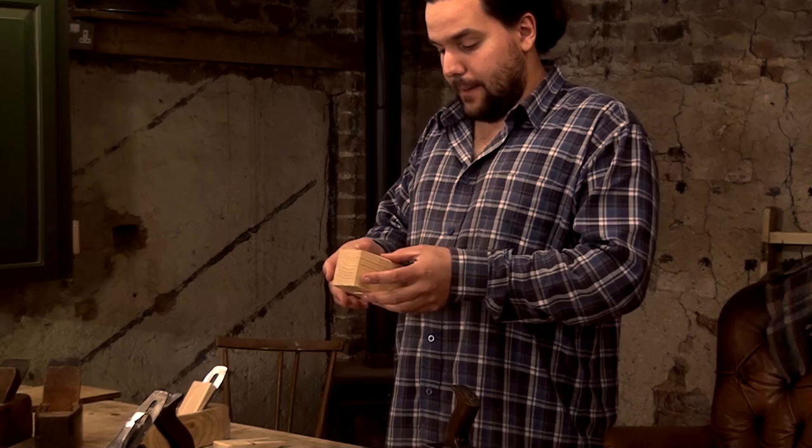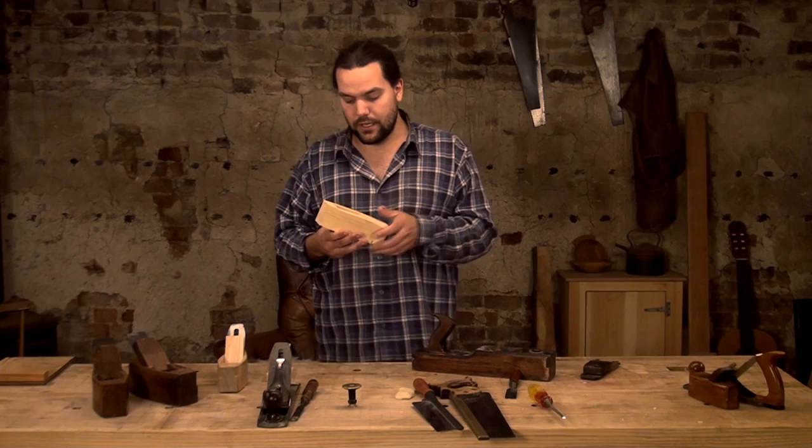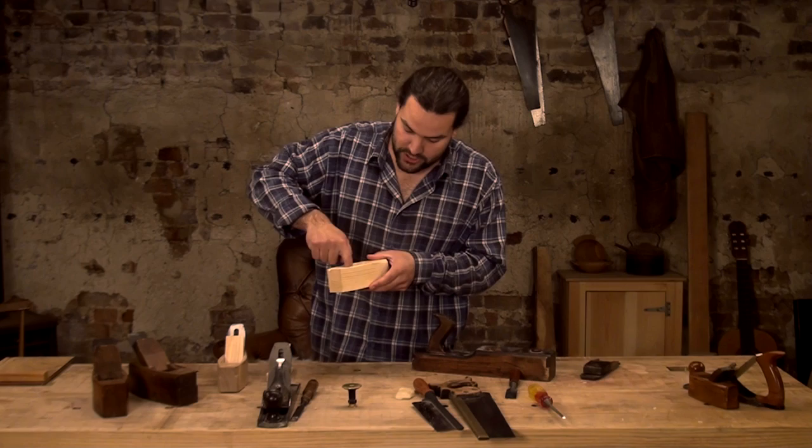So to get around that, what I came up with was just a three-part lamination — it's probably been done a thousand times. Basically all the bed and the throat have been cut, hand sawn and then planed, so they're very accurate. Far more accurate than probably the best of planes done with floats using traditional methods. The side pieces have all the cheek and that lot cut in just with a saw and a chisel, and then we fold it all back together and glue it.